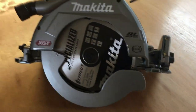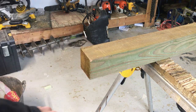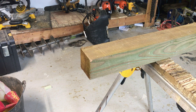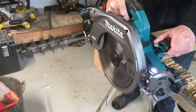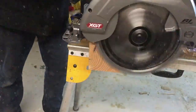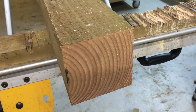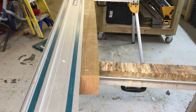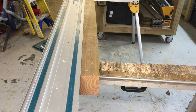It's just a quick overview of the saw, and now we'll get into what it can do. Firstly, I'll just demonstrate a straight cut — this is an old four by four post. I'll take it from a couple of different angles so you can see the saw in action. The cut quality is pretty good, minimal tear out — perfect for square cutting four by four posts. Now I'll demonstrate cutting an angle on the post, which is when I would use the track.